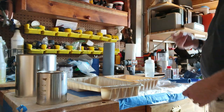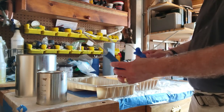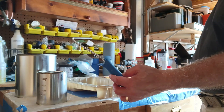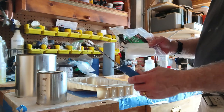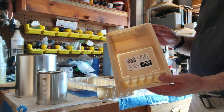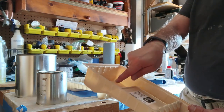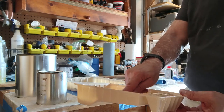The other thing I want to talk about are the dishes and rollers. This one is a four inch and this one is a six inch — they look a lot alike, one's just two inches longer. We're using the four inch rollers, so make sure you have the four inch rolling handle to go with it. As for the pan itself — I got these at Lowe's — when you put paint in the pan, just fill it up about halfway. You want to be able to roll it out on the smooth level section.